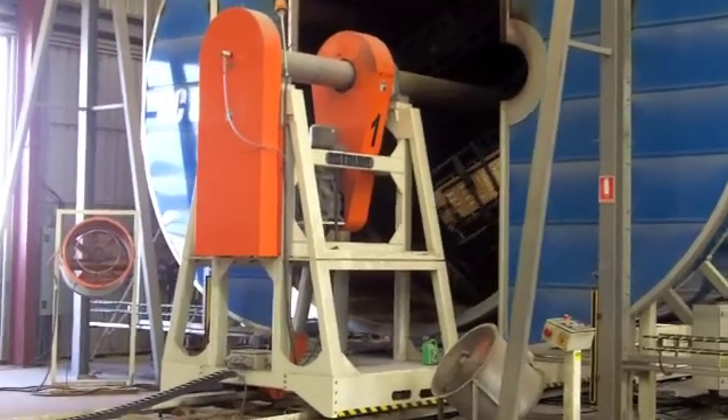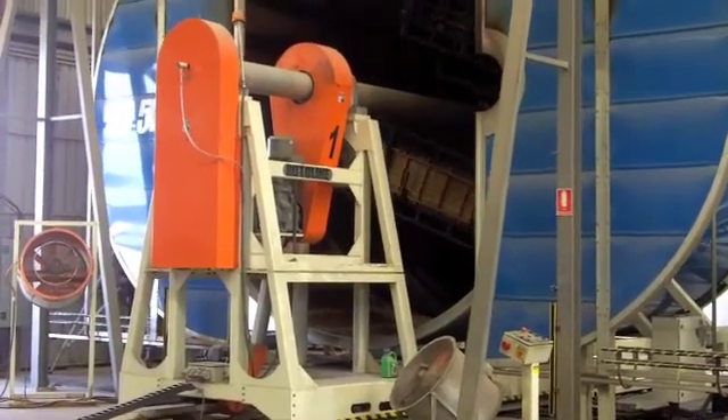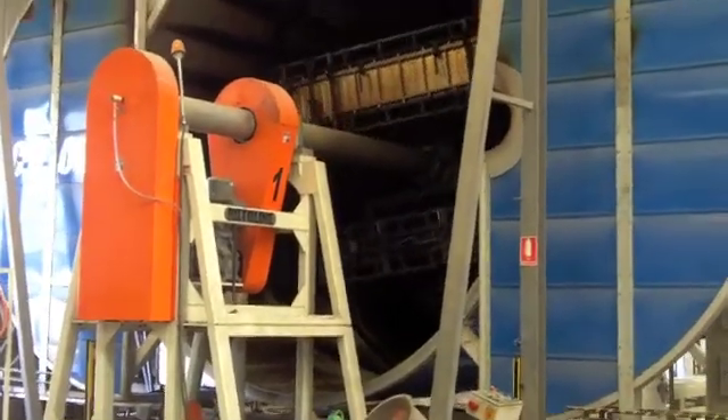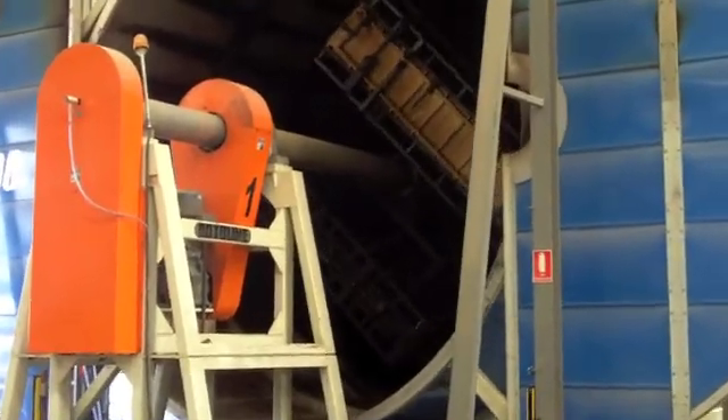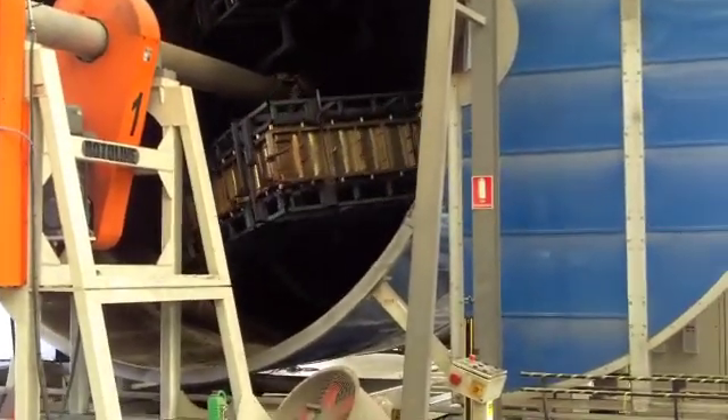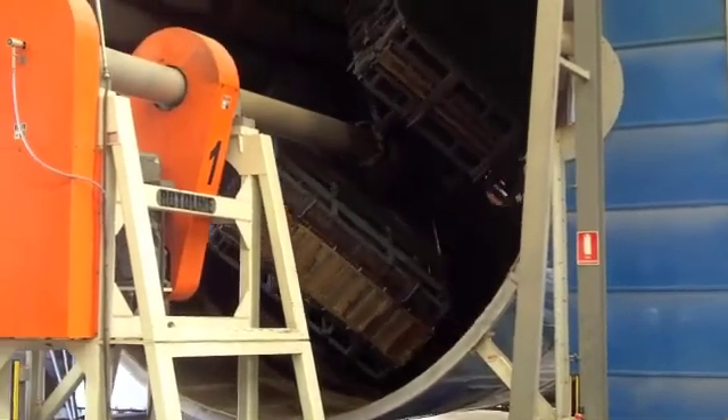Once the Thin Tank mold is in the oven, the mold is then rotated using the large arm, and it is the heat of the oven that actually liquefies the polyethylene powder, which begins to line the inside of the mold. All polyethylene rainwater tanks are manufactured using this method.